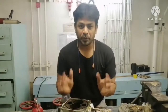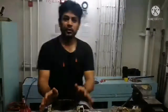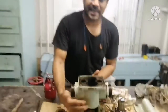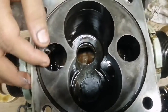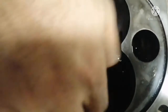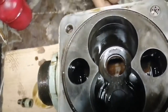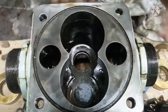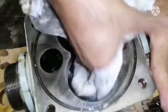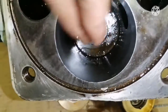I have shown you how to disassemble a gear pump of a purifier feed pump. So again I am telling you the parts of this gear pump. This part is your casing, and this is your inner casing. Whenever you do any overhaul, you have to ensure this inner casing surface is free of any kind of score markings or damage, as it will affect your gear teeth. You can see this body is in good condition — no scoring marks, no damage.